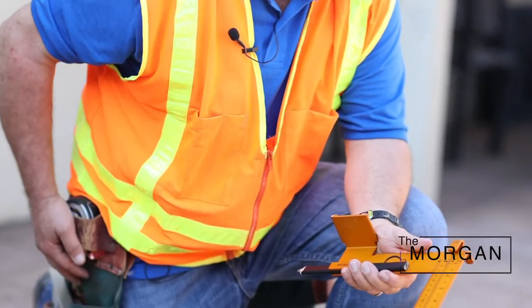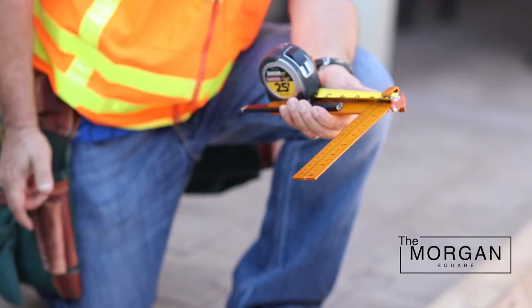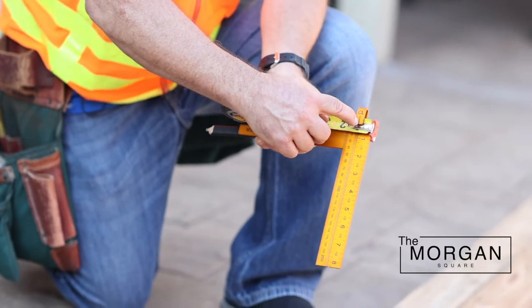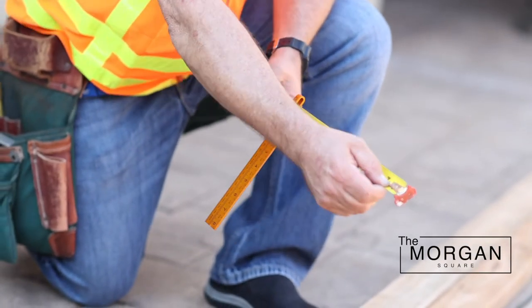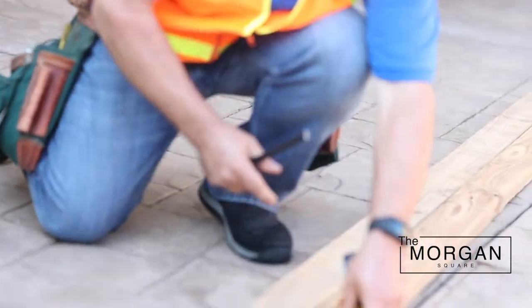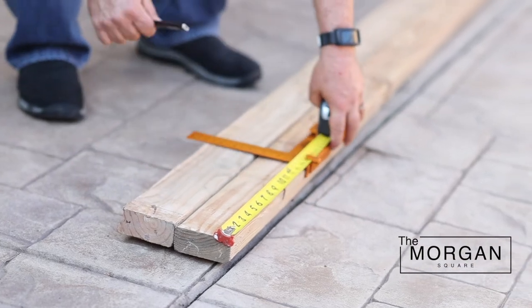Have your pencil right here. You combine that with your tape measure already on the square, and you don't have to do the minus three-quarters because you have the center line right here — you just line it up with the 16-inch mark on your tape measure. Here's how this works: simply hook it onto the stud and slide on out.